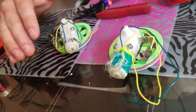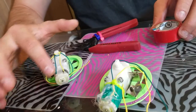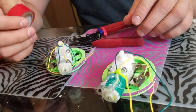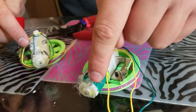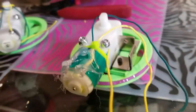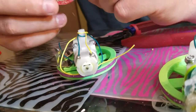All of the rest of the stuff that we're going to do is to make sure that the soldering — these solder joints that we just made — don't break. The difference we're going to cover right now is there's tape on this one between where the wires connect and this metal band. So I'm going to put that same tape under here, and then later on there's some hot glue that goes on top, but we'll do that later.